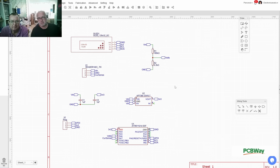All right, the rest, well, we have an ATtiny 1614. This is the CPU down here. I didn't draw this very nice. Just follow me here. And it doesn't need so much. We have SCL, SDA. And if you're wondering why I chose these pins, if you look at the documentation on GitHub, the good documentation for the ATtiny core, you find that these are defined pins for SCL, SDA, so I2C communication. So these must be on these pins. You can shift them, but normally you use them there.